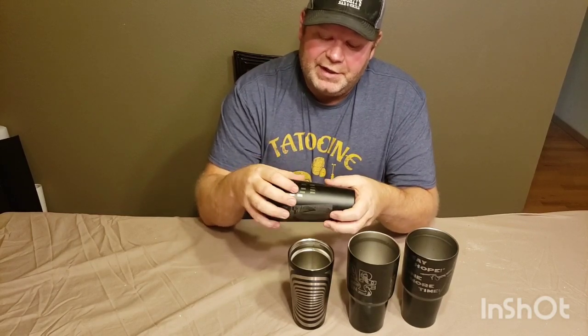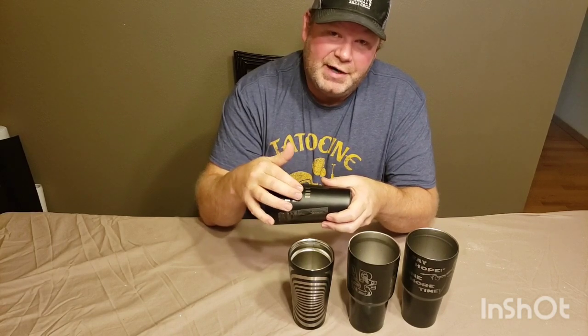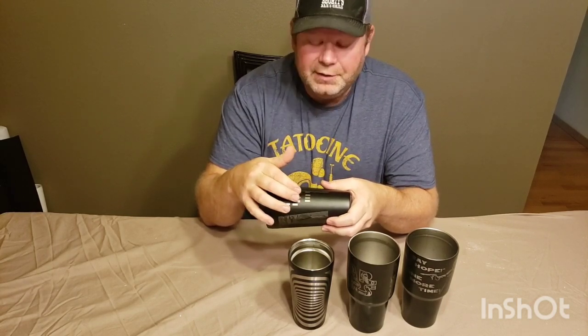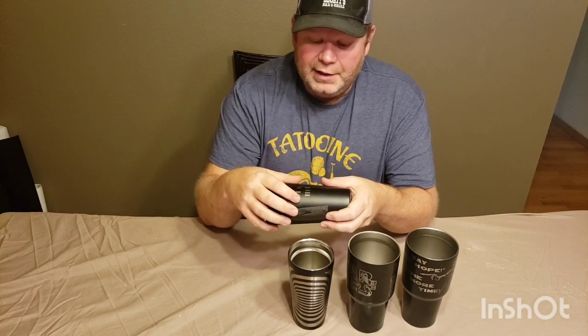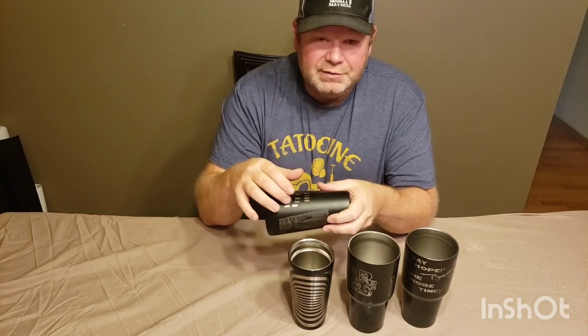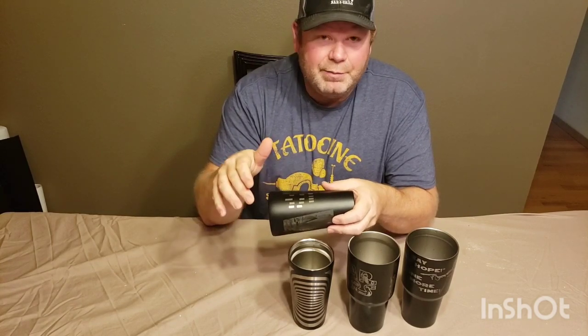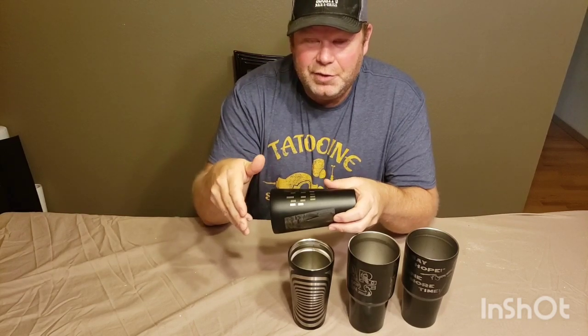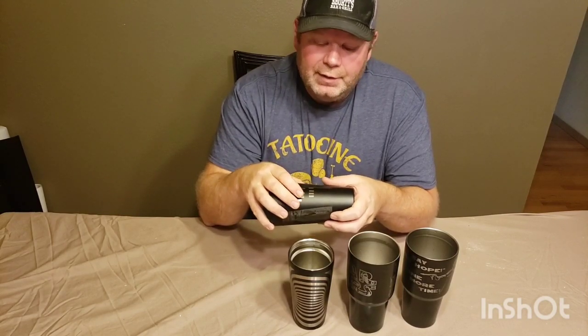So I just kept stepping it up, and I started off doing like 300 millimeters a minute, slowly stepping it up to 3,000, 4,000, 5,000. Then I jumped to 7,000, then 9,000, and said, heck, I'm going to 9,900. And even at 9,900, I was burning it, take a light little rag, wipe it right off. It was right to bare metal. With my Ortur Laser Master 2 Pro, I'm at 9,900 speed, basically as fast as you can make that thing run.